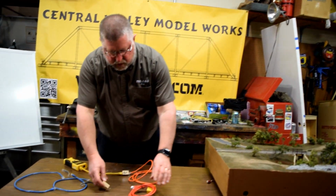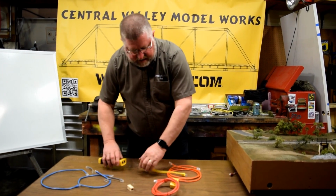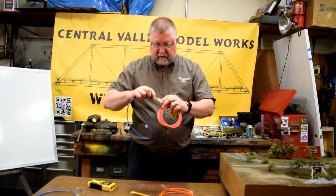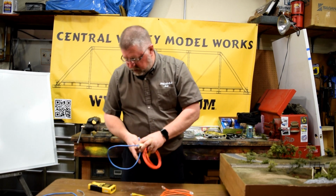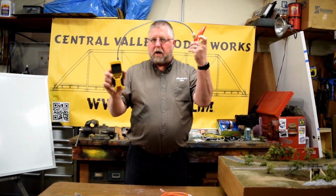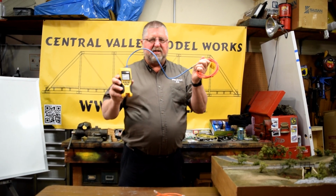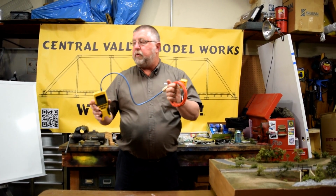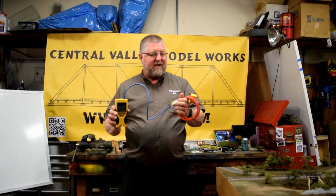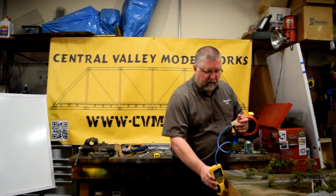Now, just to add a little bit to the mix, if I have a single crossover and my straight through connector and a straight through cable, and I hook it up, that equals a crossover, because there's one crossover in there, and a straight through cable is still a crossover. So it's important that you know your crossover cables from your straight through, and that's how we talked about that there's times when you can use a combination of them. It depends on what you're doing, but you have to have an odd number of crossovers from end to end so that your entire module looks like a crossover from one end to the other end.